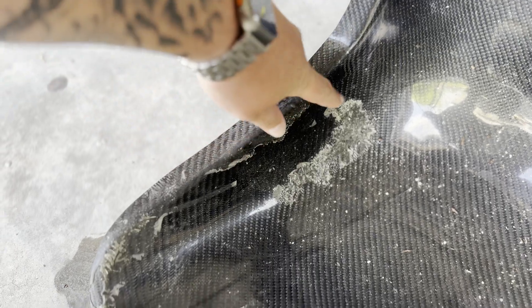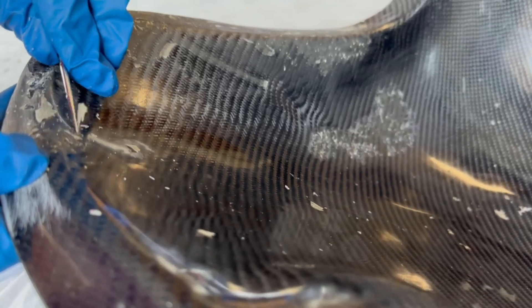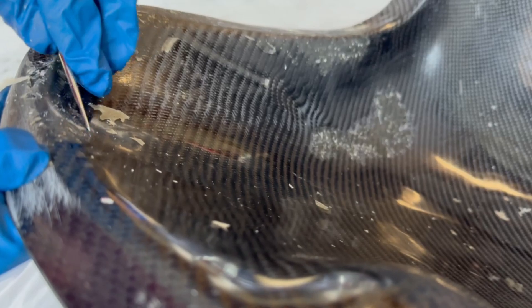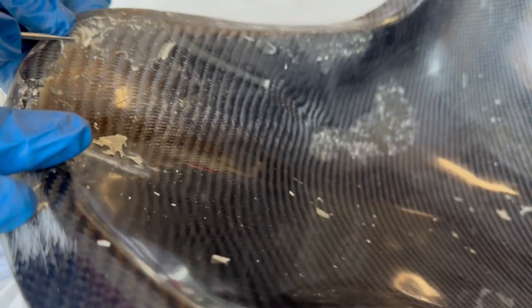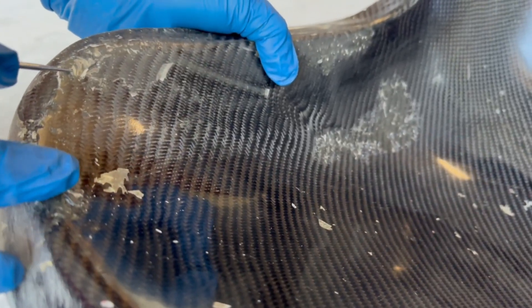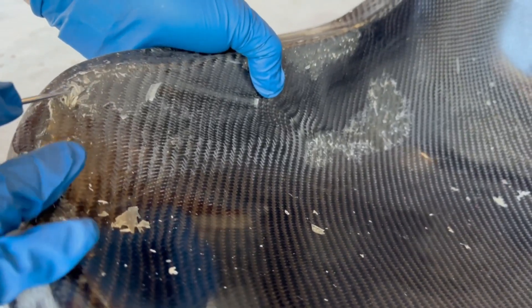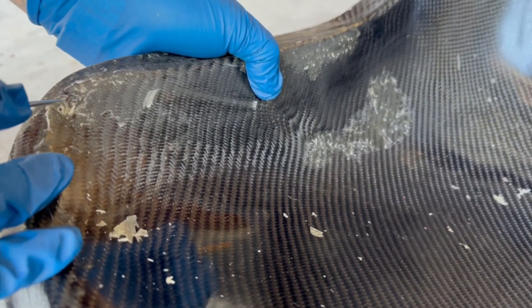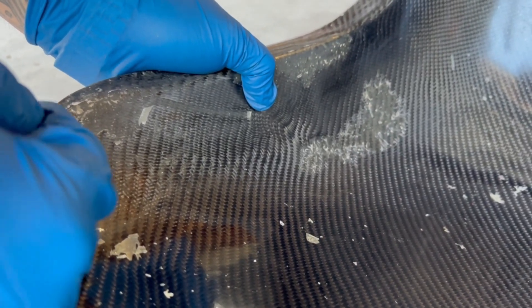So what I'm talking about — you can see these little voids and imperfections here. You want to just take a little pick and actually scrape all this stuff away. The easy method is to just sand everything, but it's a big pain, so don't go right to the sanding step. You can see these little bubbles — you want to get all of this delaminated resin off of there to minimize how much sanding you need to do.